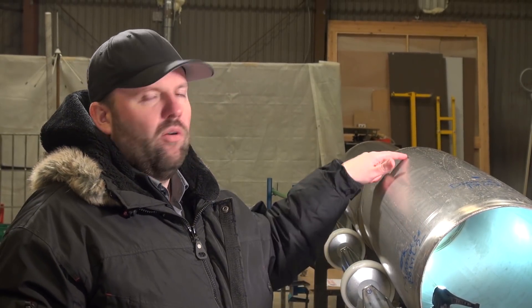So what we learned from this is, first of all, it did rupture at the end cap — quite an interesting experience. But it also teaches us that our welding skills are not fully fine-tuned yet. We need a better welding factor here on the end caps, but that's a process adjustment — this is something we can do. We're going to repeat the experiments, and next time it has to be along the length axis that it ruptures.